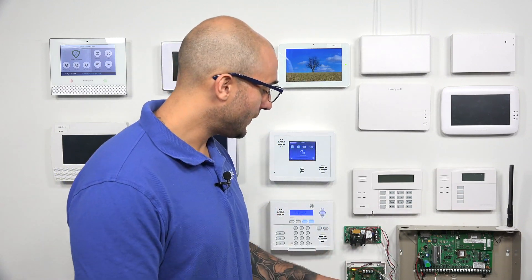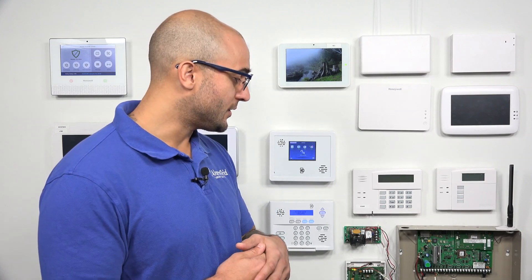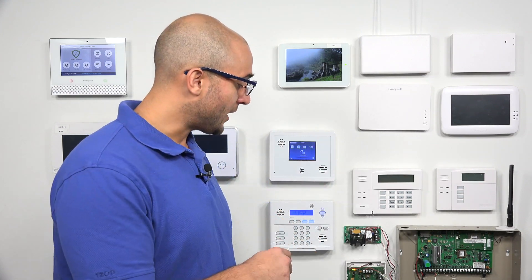There are a couple of things you may also be able to take from your main alarm system. One of the main ones is resistors. The way the 5800C2W sees that a zone is connected to one of its terminals is that it needs to have a 1 to 10K resistor attached. The unit ships with nine 2.2K resistors, which will work if you don't have them available. But if the existing alarm wiring already has resistors attached in your main alarm cabinet, you can simply take those wires off the terminals, put them on the 5800C2W, and it will work just fine.